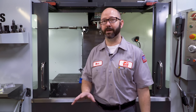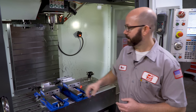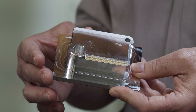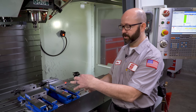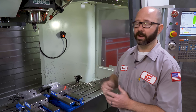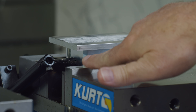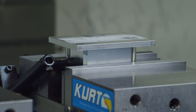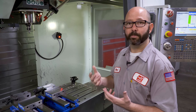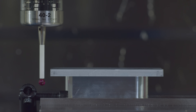Here's a situation that comes up fairly often when we try and use a probe or an edge finder to pick up a part. I've got a little tiny part that's made out of a great big piece of aluminum. If we try and run the second operation on this part — just flip it over and put it in the vise — before we can run the second op, we need to set the zero. Our zero is the left edge and the back edge of this part along those two surfaces. If we come down with our probe and try to probe that surface, the probe is going to shank out on that white ceramic shank. It works when the ruby tip makes contact. So how do we solve this problem?